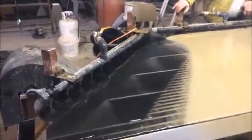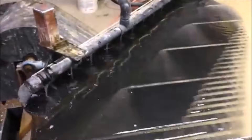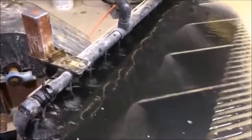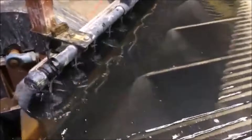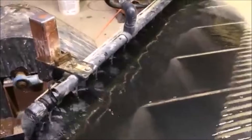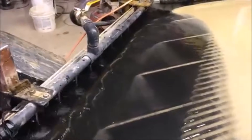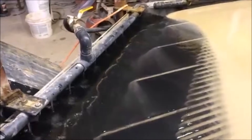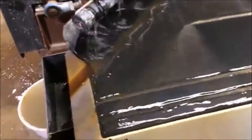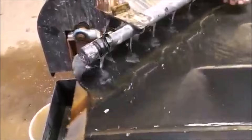Here's the gold line with the high-pyrite material. We've just run the magnet across to get the steel off, and it's really pretty clean now — very little pyrite remaining. The pyrite is coming down out of the ends of the four long grooves and into the safety grooves, so the material going off into the high-grade port is pretty darn clean.